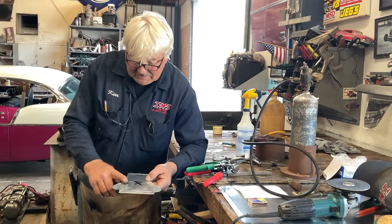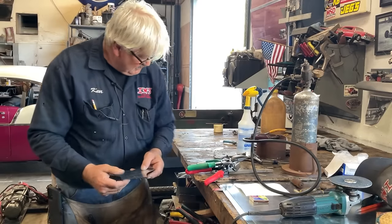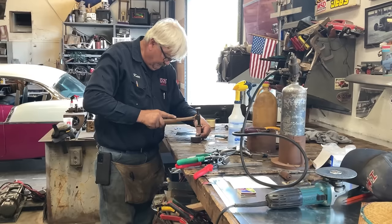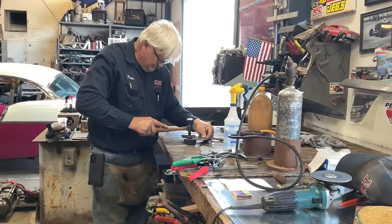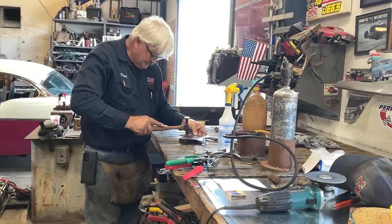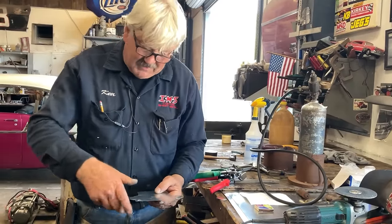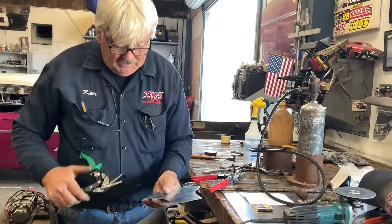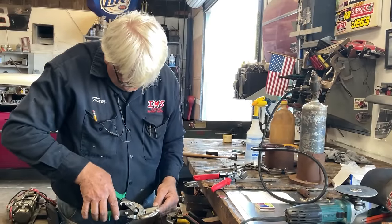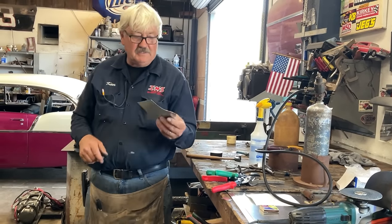I've made sure that the bad side - the hawk bill - is on the back side of our letter, and the front side has a real nice finish. We're also going to double-check this with our little hammer. Anytime you're cutting very short radiuses it makes it difficult on the snip and sometimes it'll cause that lip to turn up. I see a little spot on the end I want to change. Let's go over to the brake and bend this letter up.